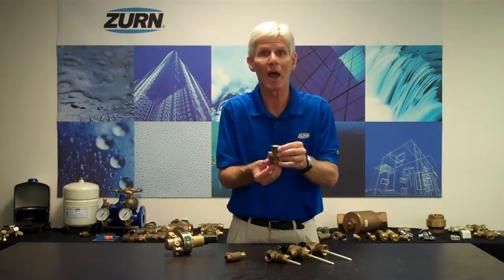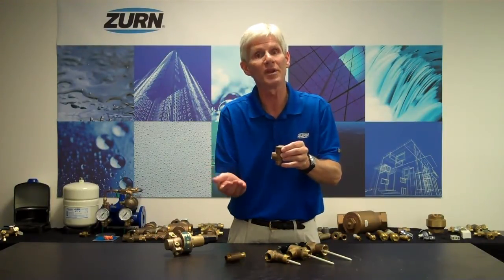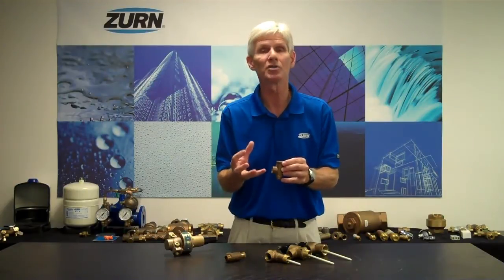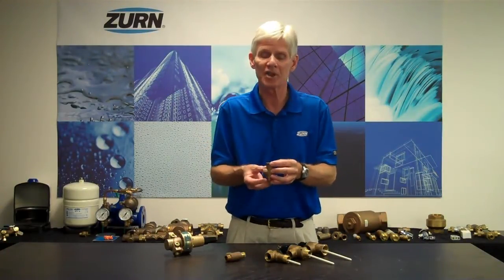Therefore, with this 100-pound relief valve, the pressure in the system would have to subside all the way down to 80 PSI before this relief valve closes. The reason I want you to know this is very important — we get calls all the time for relief valves to be used for thermal expansion control. For example, a customer may call up and say: I've got a system that's operating at 90 PSI and I want to protect this system, therefore I'm going to put a 100-pound relief valve on that system.